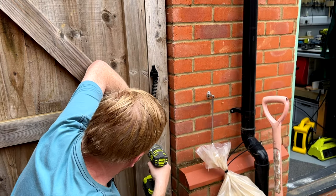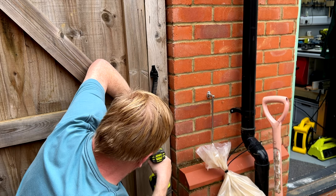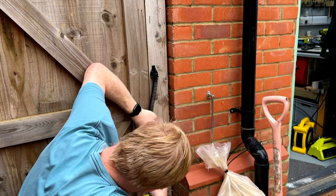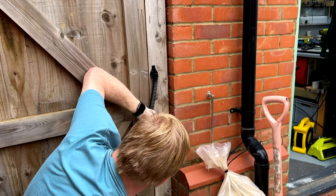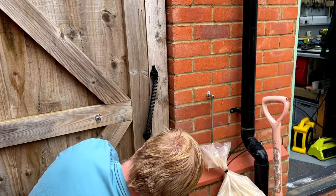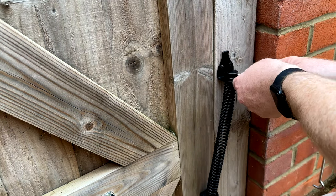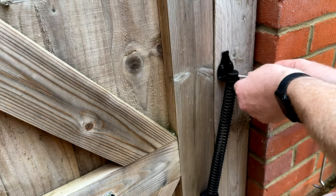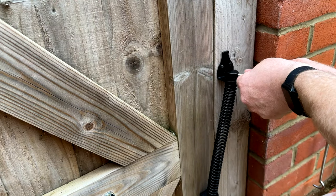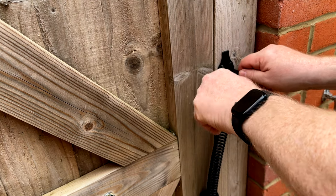You have to take up the slack in the spring and put the bottom one in. In order for the gate spring to work correctly, you need to apply some tension by winding the capstan at the top of the gate spring with a bar, and then you leave a peg in the capstan that locks in the tension.